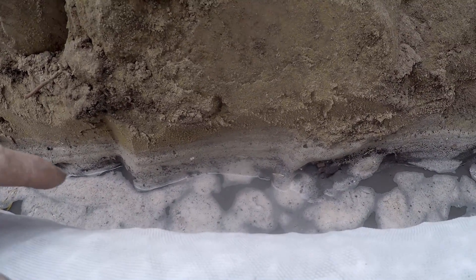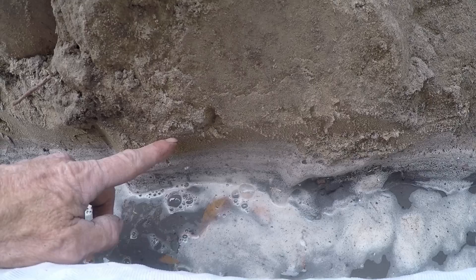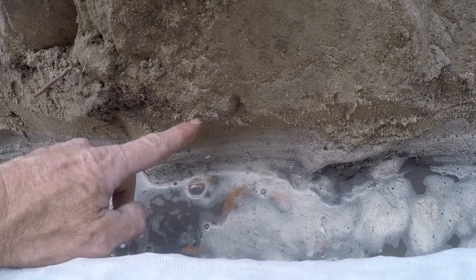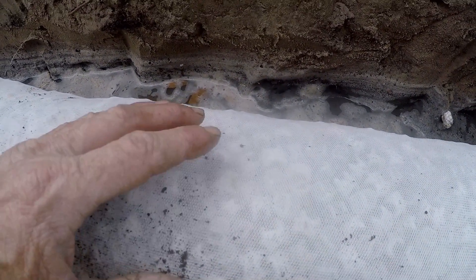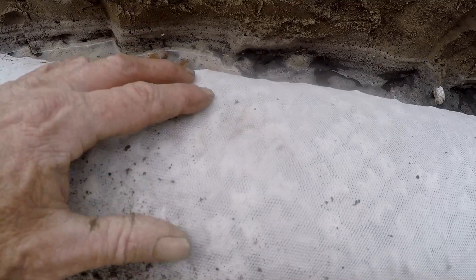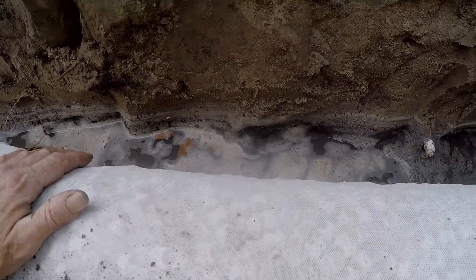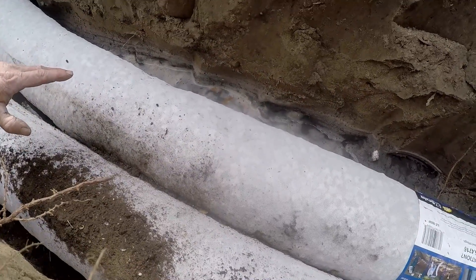To help understand how a drain field works — you can see the water down here, and when we opened up from the chamber, you can see the water level just a couple of minutes ago. The water is dropping and receding so quickly. This works the opposite of a French drain — remember, a French drain collects water, but this is going to discharge the water. The water comes out through the slots of the pipe, through the peanuts and perforated material, out through the fabric into the ground, and that allows it to just perk and get soaked up by the soil. We've got two big drains running through here, just to add to the chamber that's already been here.